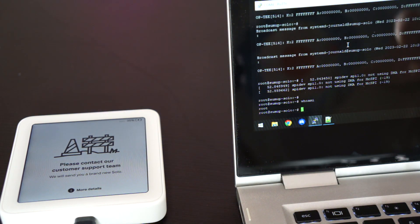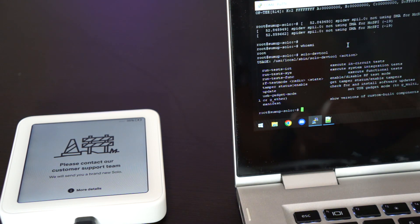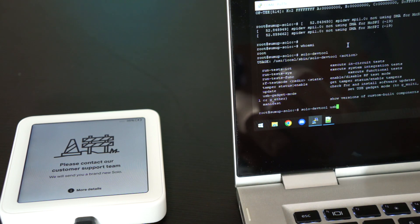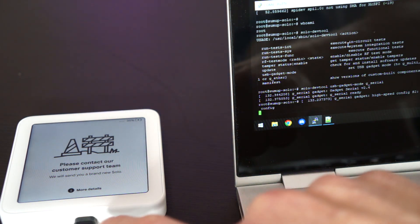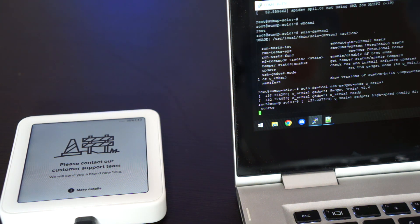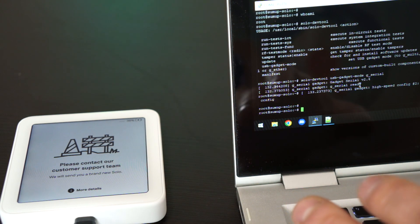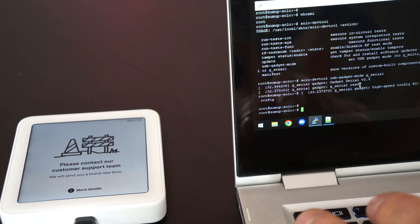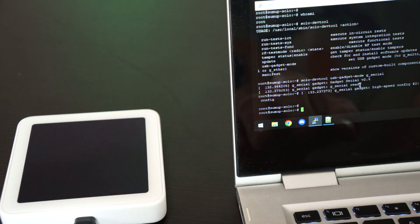This allowed me to dump the whole memory and also to reverse engineer how the basic things work. For example, there is this solo dev tool we can use to enable the USB connection on the USB-C plug. I enabled the g_serial mode, which allows using the USB-C connection to transfer data. It also ends up in a root shell but is not enabled on boot. That way I was able to transfer data fast back and forth, though I only used UART initially — by base32-encoding all the data I wanted to transmit, sending it over UART, and decoding it back.